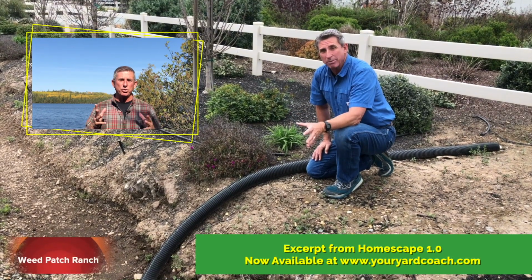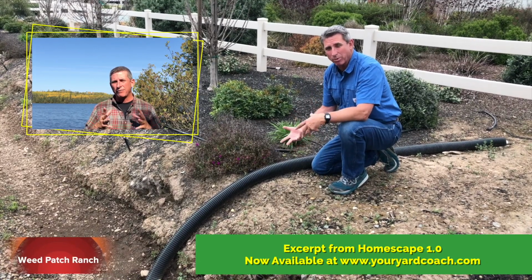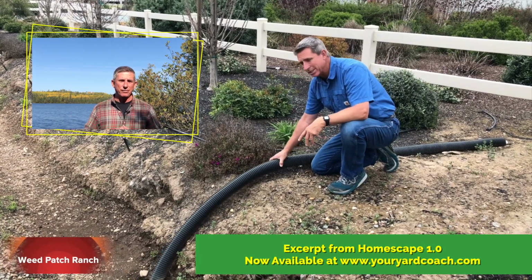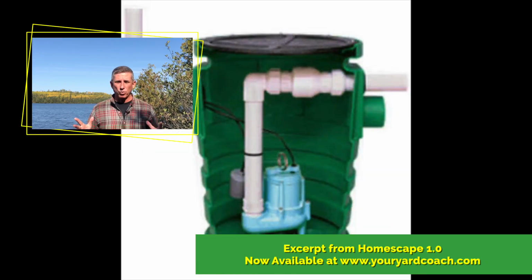You know, at the main house that we're talking about, I didn't hardly have any slope or fall there that I could deal with. So I had to create my own. So the beginning of the French drain was about 6 inches deep, including pipe and everything. And by the time I ran it along the back of the house and down the north side to the basin area, I was able to achieve about 1.5 to 2% pitch. The end of it was probably about 13 to 14 inches deep, and it ran really well.